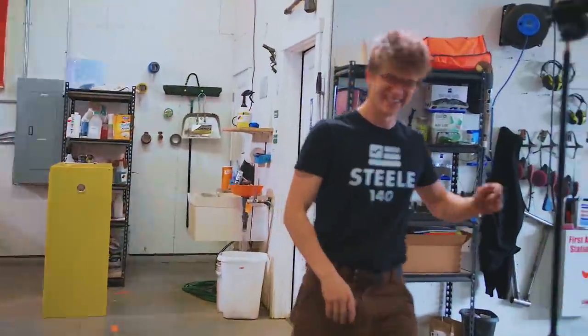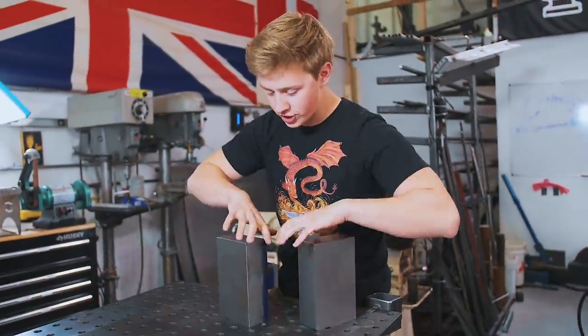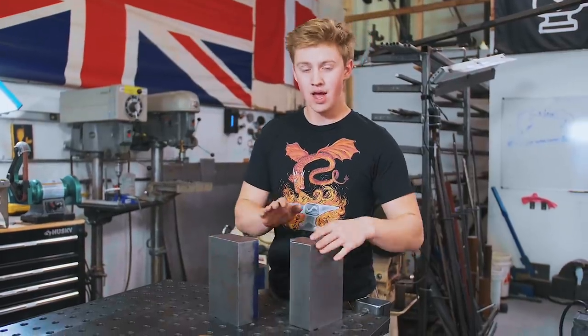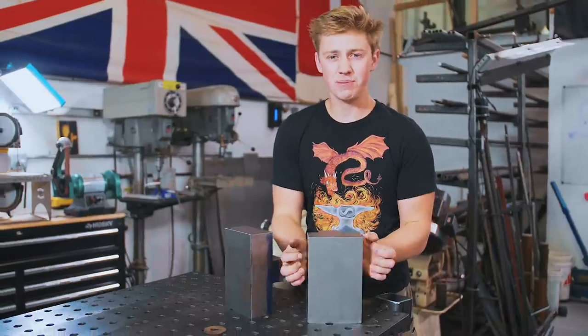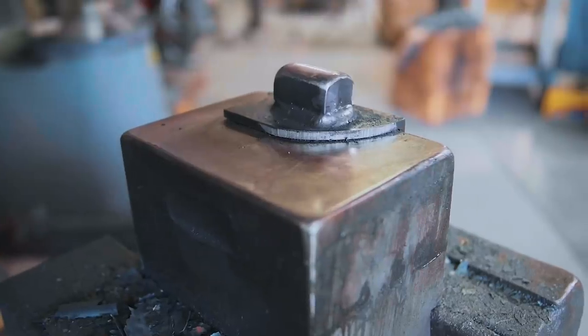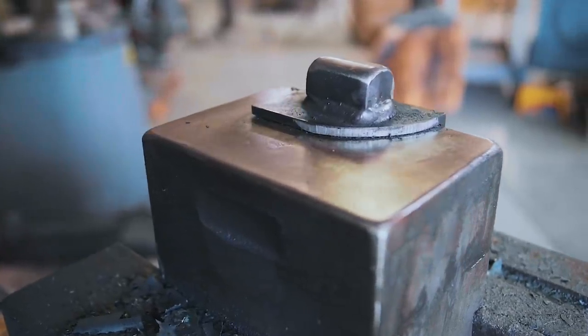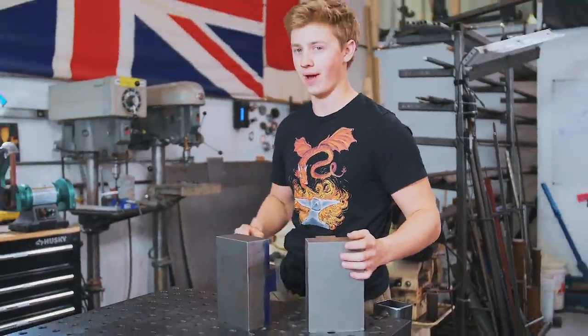It's a good one! But actually, what I've got to do now that they're all shaped, I'm gonna go ahead and just start radiusing all of these corners, playing with the surface finish a little bit on the belt grinder. I don't want these crispy 90 degree angles because when I'm forging on this hammer, we want it to be a little bit radius like it is on the other two hammers that we have, so that it's not forging cold shuts into our work pieces. We're just gonna kinda cut nice chamfers all the way around.